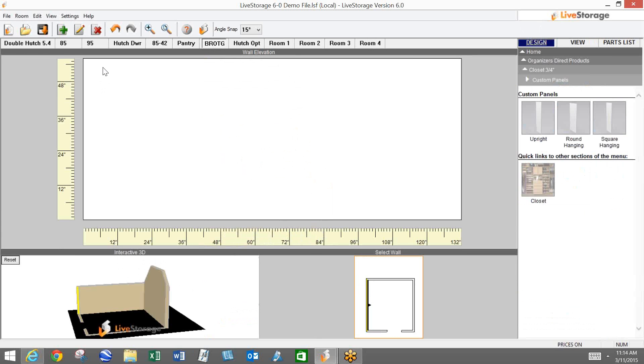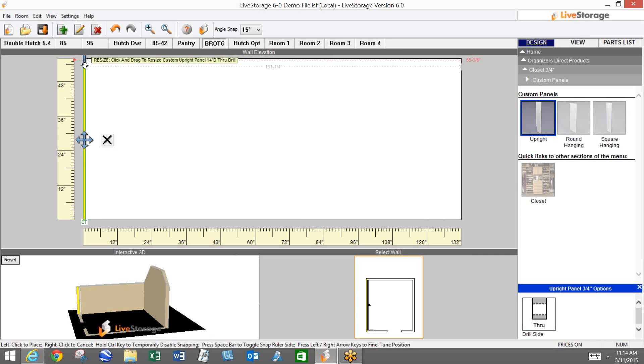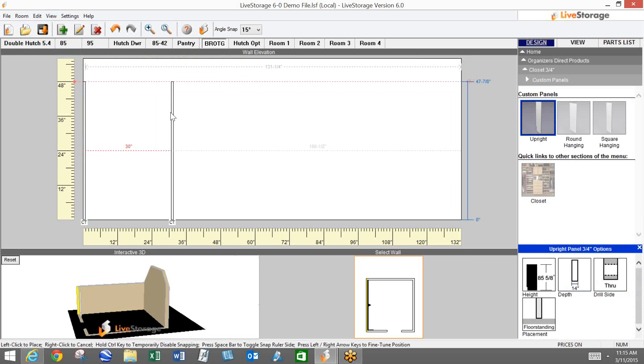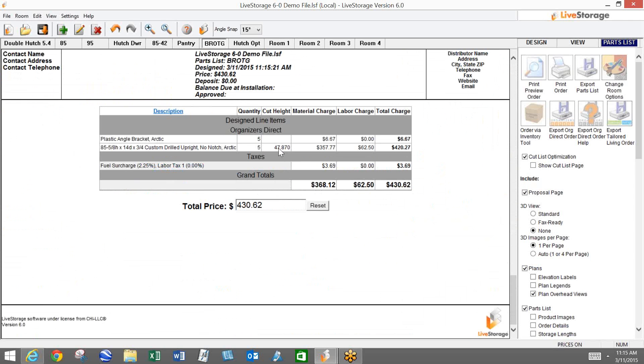Here's an example — a bonus room above a garage or attic space type closet. This is where the custom floor-mount panel really helps out. I have about a 60-inch tall wall. When I choose my custom panel and drop it in, it automatically sizes itself — going about one inch below your wall height. You could drop it down a bit further to give some shelf space above. Here's a good area to use that copy and paste feature: copy that panel and paste it along the wall. All these panels show the letter C for custom. The T stands for through-drill panel. When I look at my parts list, I can see that dimension — currently at 47 and 7-eighths of an inch tall — and when I export to the order form, that dimension comes with it.